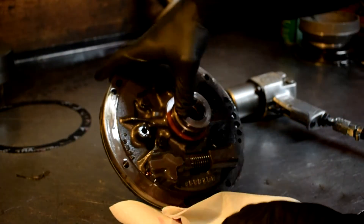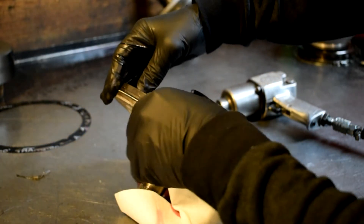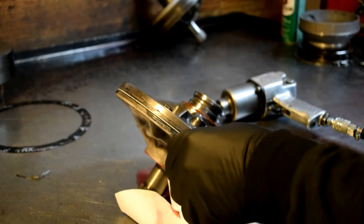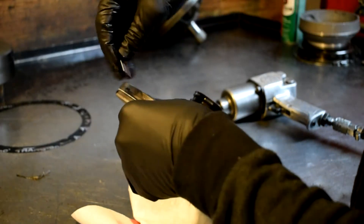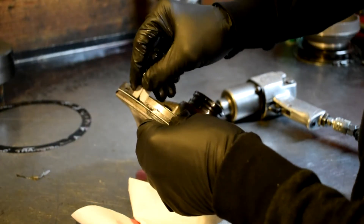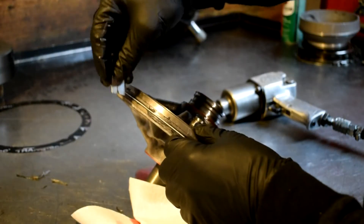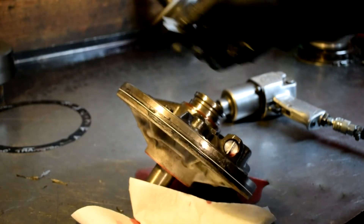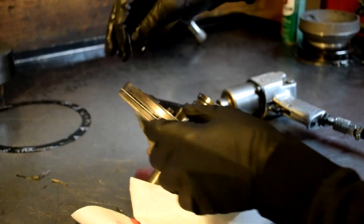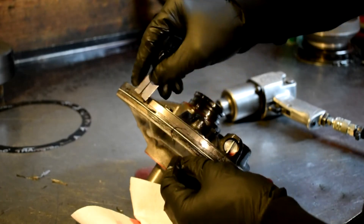One thing I really want to point out that I absolutely hate: some people use silicone on these pumps. Honestly, 30 years of doing this stuff, I've never had one of these seals leak on me. If there's a leak problem, it's because there's a nick in the case, or something where the O-ring isn't able to do its job.